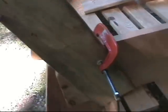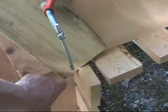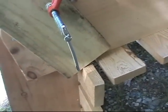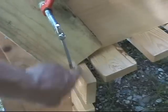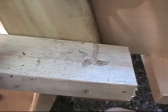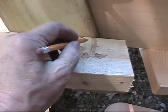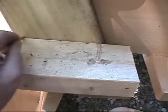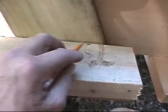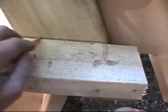We'll have to cut this angle here, but before we do that, we've got to cut this angle. We just can't slap this in there looking like that. I'm not a perfectionist, but I do like something to look a little better than that. In order to get that angle, we don't want to take off too much here, but we've got to look at this end over here. So we're going to drop a block of 2x4, which is an inch and a half thick, and we'll just draw a line right across here. My pencil needs a sharpening, but we draw a line here like that.